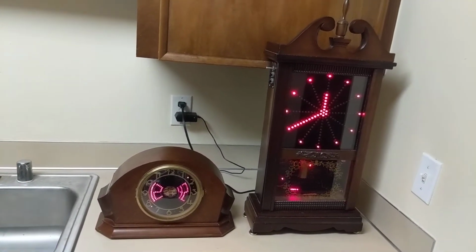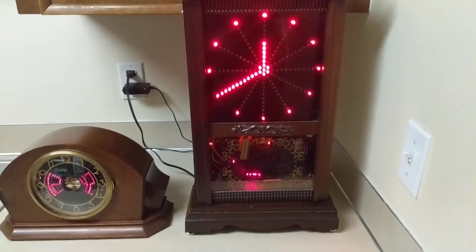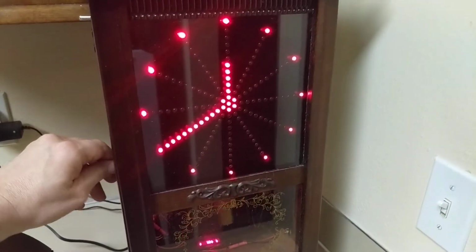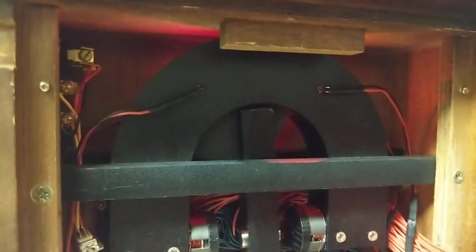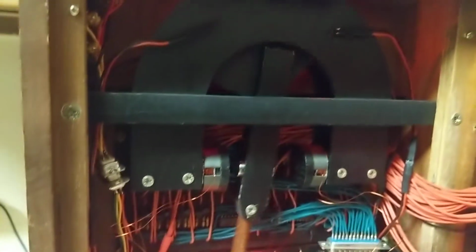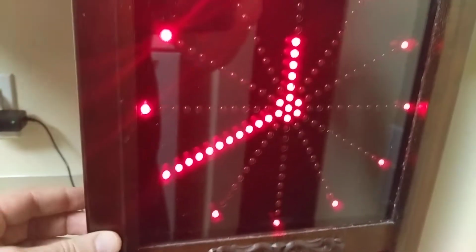And what I like about them is they're both hybrid clocks. They're both a combination of electrical and mechanical. This one is timed by a pendulum, and you can see it swinging back there. It's got an electromagnetic drive to push the pendulum, as you can see right there. It's also got some photo sensors up there to both trigger the coils as well as to count the swings.